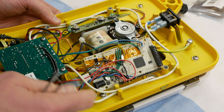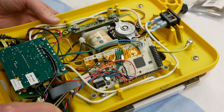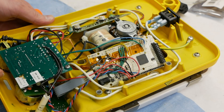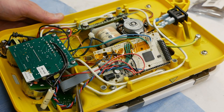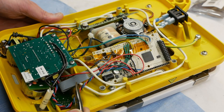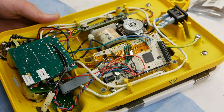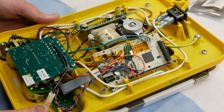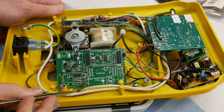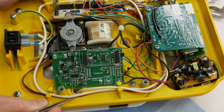This is what does the PID loop control and the interface — the generation of characters shown on the display go through this. Originally that seven-segment display was controlled by the stock board, but I just unplugged it, plugged it into the Arduino, and figured out the signaling scheme with these cables. The potentiometers for the set points also go into the Arduino. The base station coil is just these very fine wires — hard to see on camera — that go to a coil concentric with the spin axis of the motor.